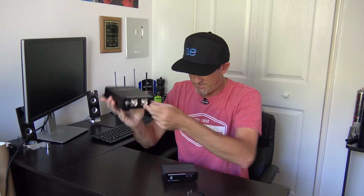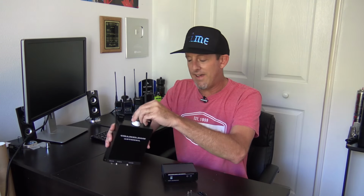That is if you have an internal antenna tuner. This is going to have everything tuned until it comes out of here. Like for instance, from here up, everything that comes out of this coax, coupler coax, that goes to this is a good, perfect match. Does that make sense? This plus this equals good. That's why I like remote tuners.